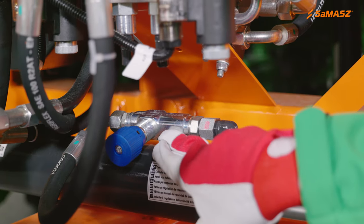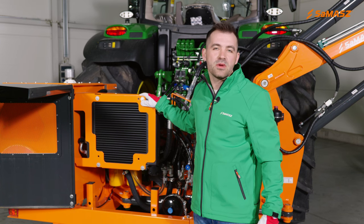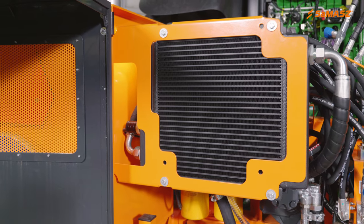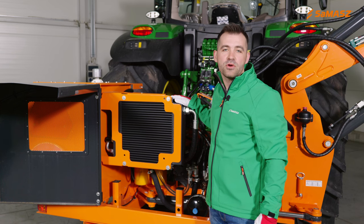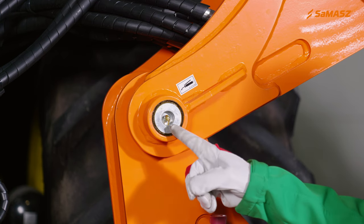What else improves the smooth operation of cylinders is the choke valve. With this blue knob, we adjust the speed of its operation. The KWT extension arm has its own oil radiator with thermostat, which controls temperature and prevents the hydraulic system from overheating. The radiator's fan has a reverse function, which cleans the fan of any debris. Additionally, to reduce power demand, it is equipped with a soft start function. You need to pay attention and grease your machine — here is a decal that tells you where the grease point is located.